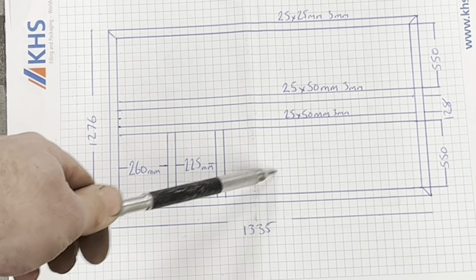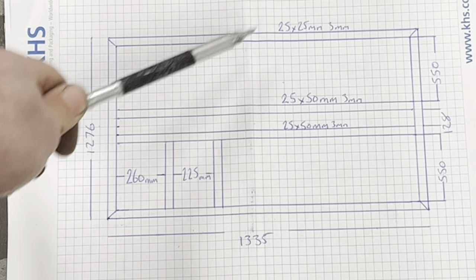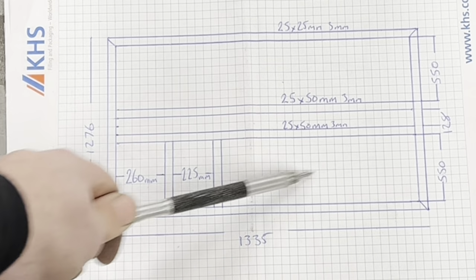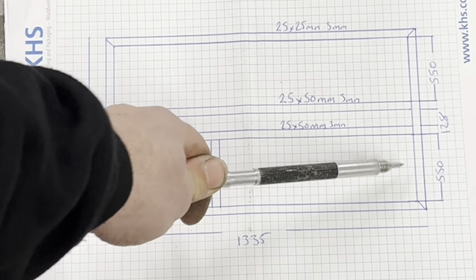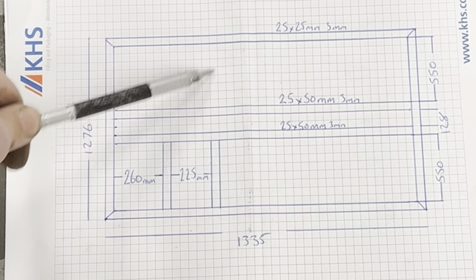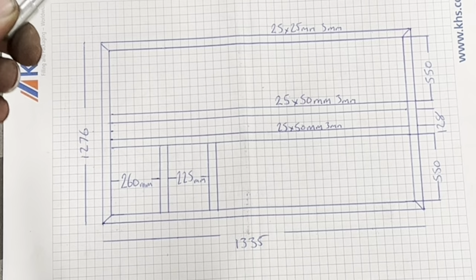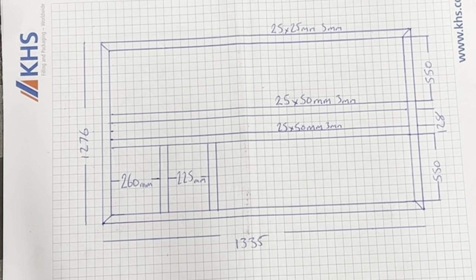You will need something in there, and you will need something in there. Whether you just want to put a bar here and put a big X, or want a bar from there to there and there to there, or put big X's, your pedal box is going to have to go up here somewhere, and your fire extinguisher needs a mount, your exhaust is going to need a mount. You cannot leave it like this, because you need something. X's, diagonals, triangulation.